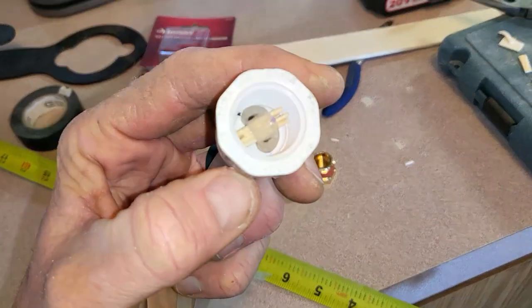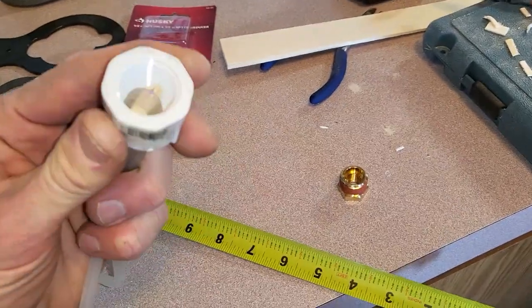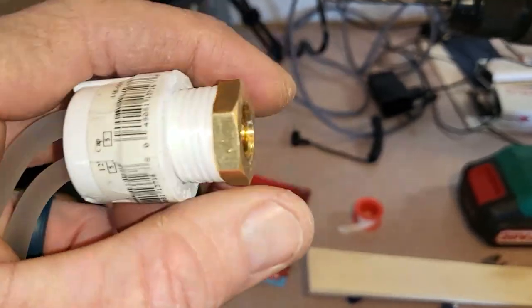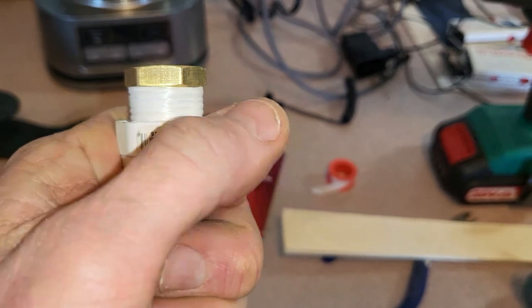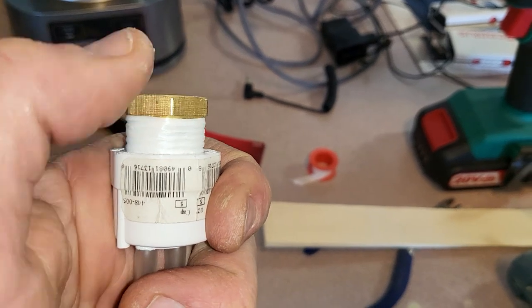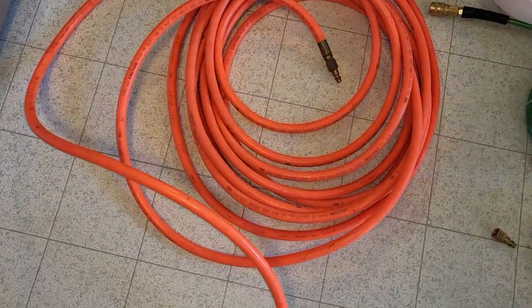The angles are still looking good. Let's put Teflon tape around the screw and thread it in — I wrapped it around about three times all the way down. Teflon tape will make your connection airtight. I'm going to hand thread it in as much as I can, then hold it steady and use a wrench to tighten it down. Don't over-tighten it or you'll crack the PVC cap.